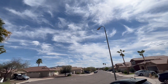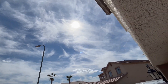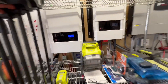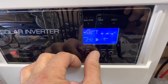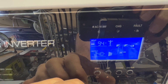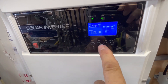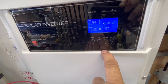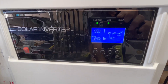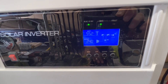Right now it's kind of cloudy out here. As those clouds come over, it drops me from 99 to 100 amps down to about 80-some amps. Then as soon as the sun has no obstruction, it goes right back up again — we're at 96 amps right now. So if I try to run that pool heater just on this alone, it can do it, but it constantly shifts with the grid kicking on and off. But with this combined, I'm staying at 55 to 56 volts and charging my battery while running that.